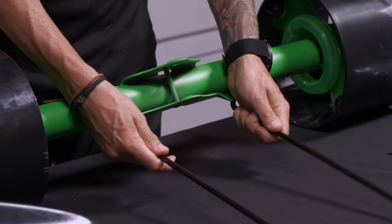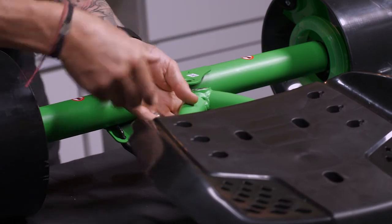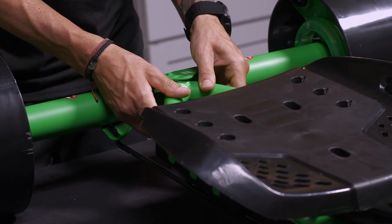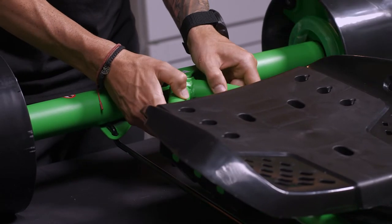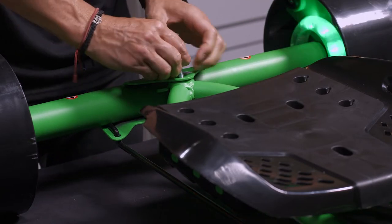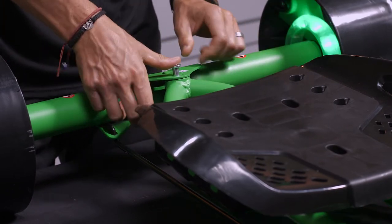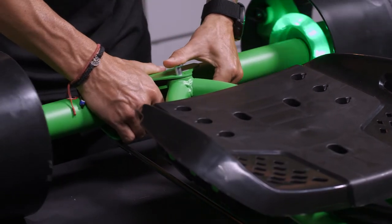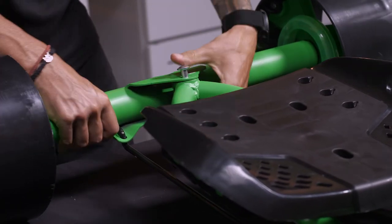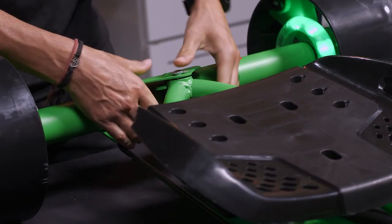Be careful not to let these drop out. Put that up front and tilt it just a little bit. You want to make sure you line up that hole — this drops down from the center and it's a little bit of a tight fit, so make sure everything's lined up. If it's not poking out the bottom, give it a little wiggle — it might not be perfectly lined up at first.